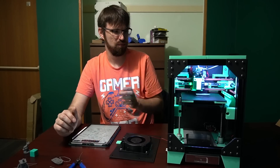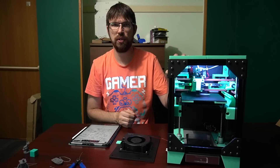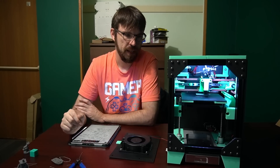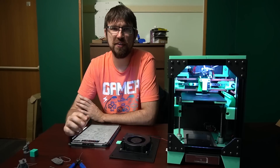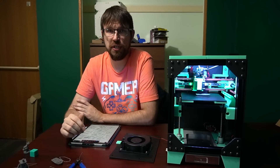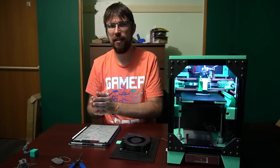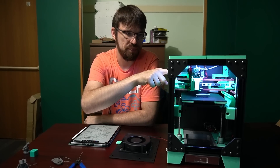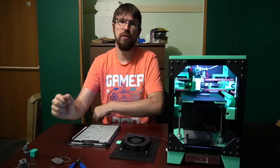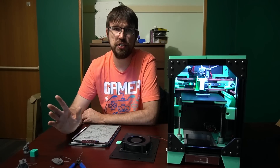The printer is very smooth when printing. I'm very pleased with the aesthetics — I think this looks really good. It looks very stout and I like the corner plates. I ended up redesigning this printer a few times, changing the belt path and that type of thing. The tensioning system on this printer is the best I've ever had on a printer — it's a compact version of the EVA toolhead, with slides in the back. M3 bolts pull the belt to tension. It works very well, the motor mounts are all rigid, and the tensioning just works really well.